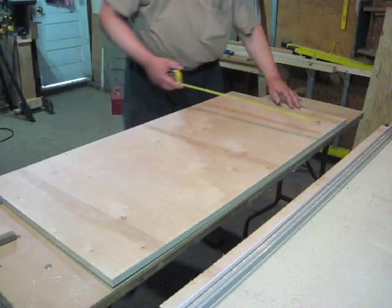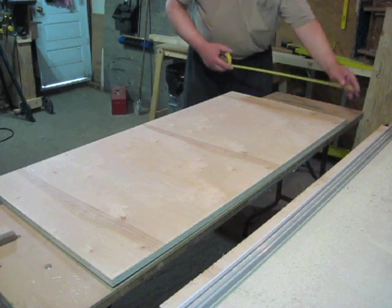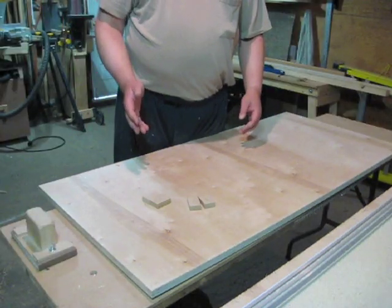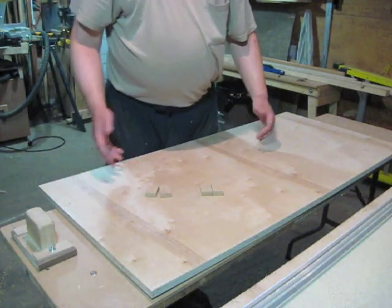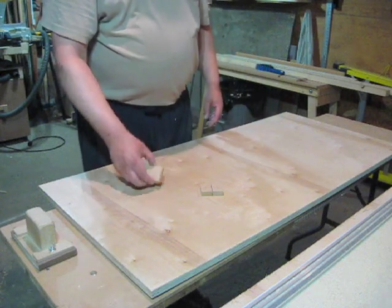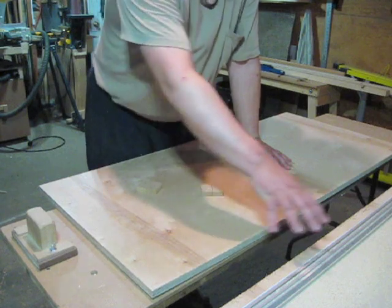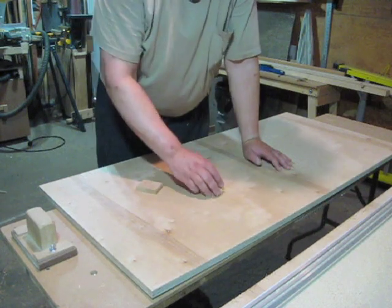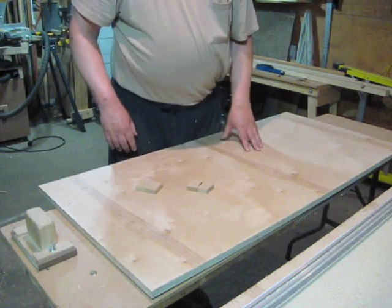It looks real good — it's spot on. So now any time I need to make a cut with my circular saw, I'll have these two sets of spacer blocks to make the job easier. Wide blocks for when I want to keep the piece on the other side from where the fence is, and narrow ones for when the fence is on the piece I'm keeping. Thanks for watching.